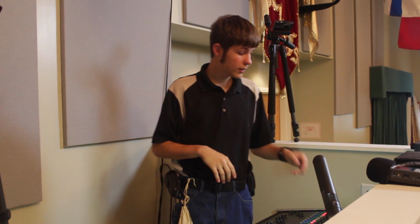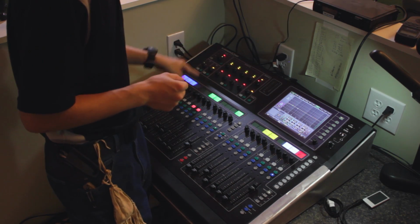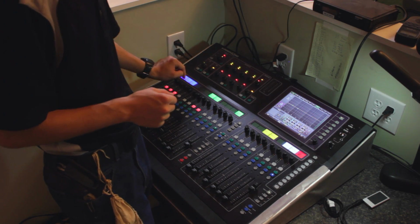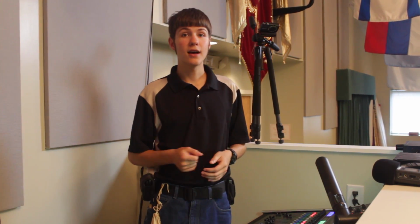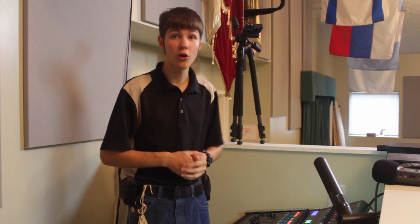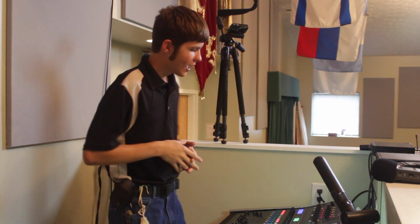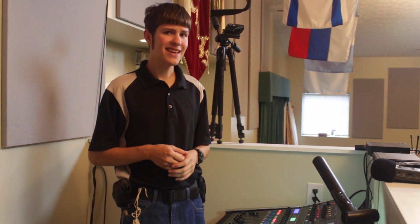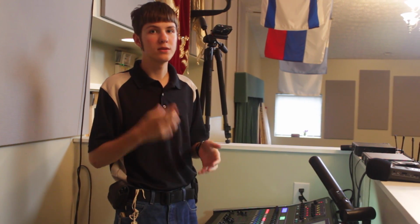So if you look here, we just talked about the parametric EQ. Right here we have our compressor, our preamp, our high pass filter, and our gate. So let's talk about the compressor. The compressor takes out the loud, hard sounds. So let's say Michael hits the drums really hard, or whoever's playing the drums hits the drums really hard, and otherwise it would blow out your speakers and your sound system, and you'd have to buy a new sound system, and that would be a big ordeal that we don't want to go into. Basically what the compressor does is it cuts off and brings down those sounds to a more reasonable level.